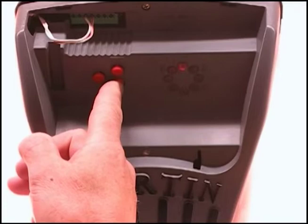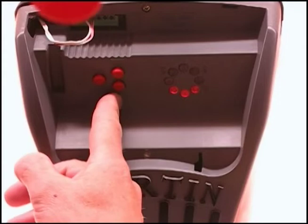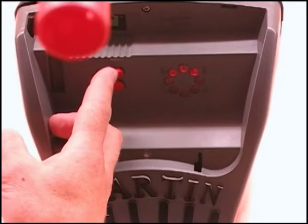This opener, by the way, is for use without any photo lights. Once you get the door completely up, you let go of the plus button. Then you push the P button again and you get into the setting for the down limit, which is the bottom 3 lights. You push the minus button to lower the door.